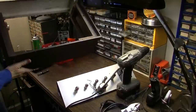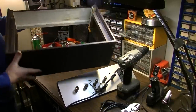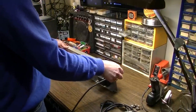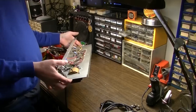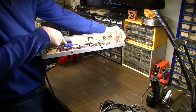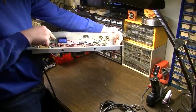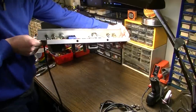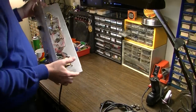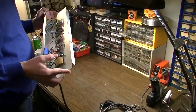And interestingly, this entire upper section of this amplifier appears to be covered. Every little surface appears to be covered in what's got to be asbestos. I don't think it's any more of a risk than the things that you come into contact with on a day-to-day basis. So this chassis is definitely aluminum. I don't know if you can see it or not. The caps have been replaced, the power caps. These Sprague's are original. These capacitors have also been replaced. The death capacitor was left in. Of course, the two-prong cord was never changed. I don't know why they would change caps, but not go ahead and change the cord, especially if it's in that kind of shape. Because those caps right there aren't all that old, so whoever was in here wasn't in here all that long ago.